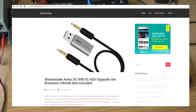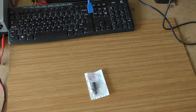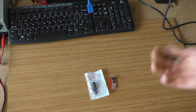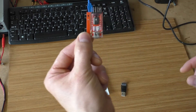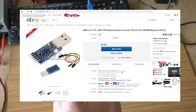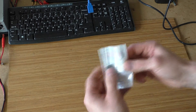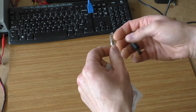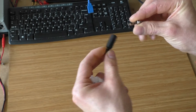We're going to need a few things to make it work. First, we need a 4-pole 3.5mm jack. Then we need an FTDI USB-to-serial adapter. You can use either of these — anything should work really. This cheap one from Aliexpress costs about two dollars and works fine. This slightly different one also works. There's a chance you may already have one lying around. The jack I got from cpc.co.uk — costs about one dollar, very cheap, looks solid quality.